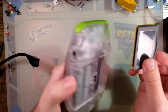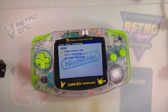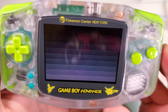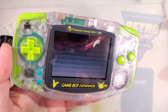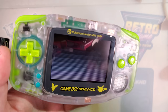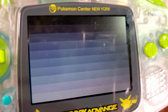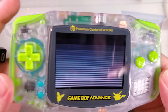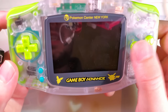First thing, I am going to try the AGS aging ROM because we want to check and see if the LCD comes calibrated out of the box. So if we pull up the AGS aging ROM, which is linked in the description, I have a website that I've set up that has links to all the handy stuff that I use, my socials, etc. But there's the AGS aging ROM in there, and if we load up the Flicker test, this first test pattern on an uncalibrated screen would produce a flickering image. Since I don't see any flickering, I think it's decently calibrated. Seems good enough. So, move on to the next test.